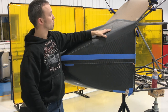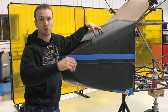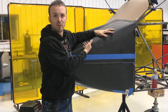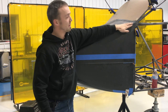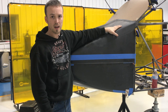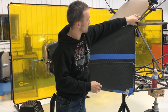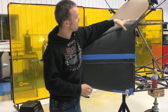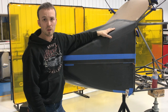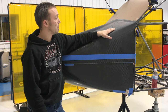After that, we took the upper cowl off. We took a bunch of carbon fiber, chopped it up, mixed it with epoxy, and then used that on the backside first to fill in the gap from the top and the side. Once that cured, we then took two layers of carbon fiber cloth — you can see there's a little bit here hanging out — and we put that over the top of that chopped epoxy mix.